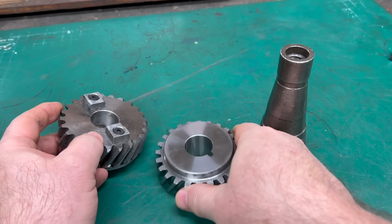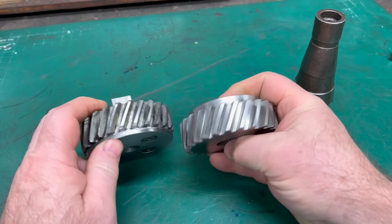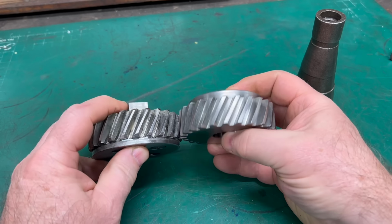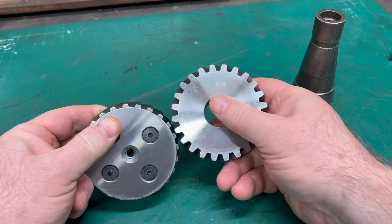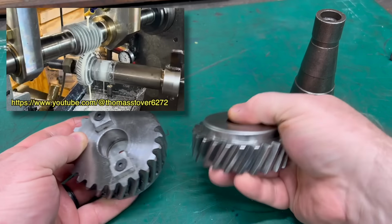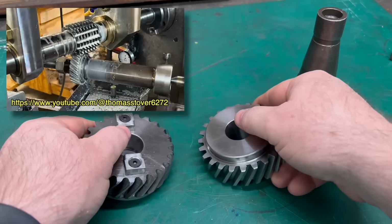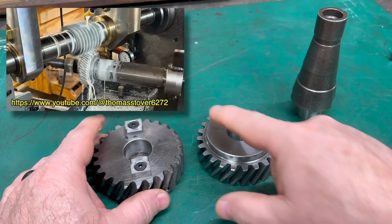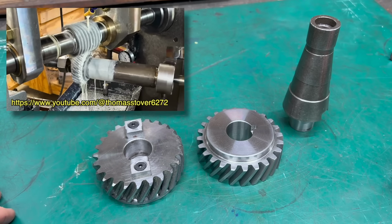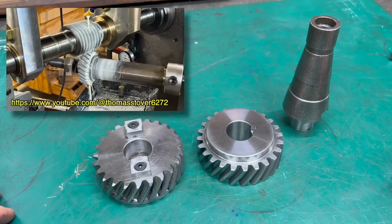A viewer and real machinist, Tom from Tom's Rabbit Hole YouTube, link down in the description, reached out and said, "Hey, I know you have some problems with that gear, and I can remake it for you." Tom has quite the setup with his homemade gear hob, it is an incredible device. So he remade the gear using a hob and also made it a little bit thicker so that I can machine in the drive dogs so they're integral to the gear itself. That way it takes away that weak point.